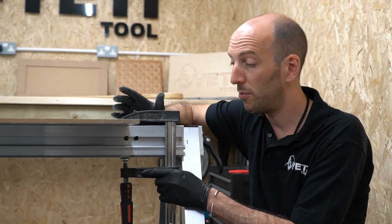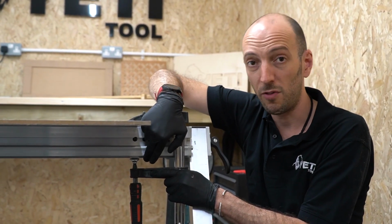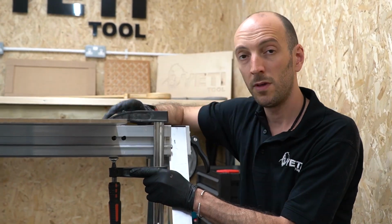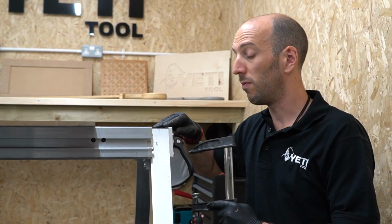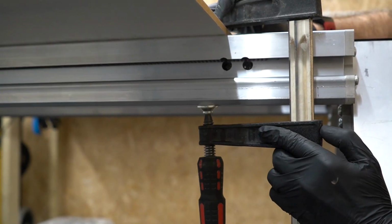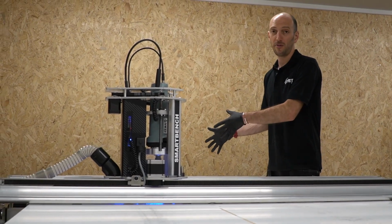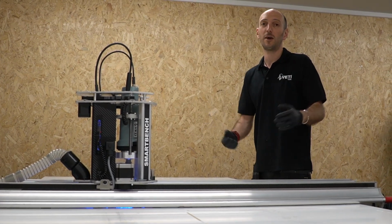If you're using G clamps, you should never tighten them onto the wheel tracks on the bottom side of the Y-bench. That's because there's so much mechanical advantage in a G clamp that you can actually deform the wheel track. If you did want to use a G clamp, it's absolutely fine to use them on the leg hinge plates, for example, which are going to take the load. We've just talked about clamping techniques at the home end of the bench, and it's worth mentioning that you can also use the far end of the bench with exactly the same techniques.